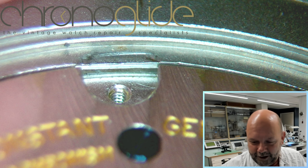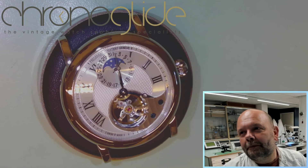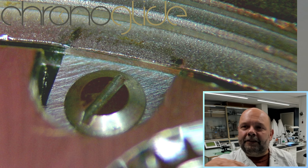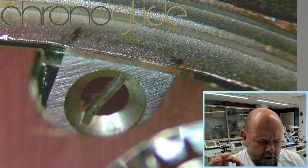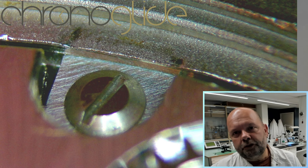I had to adjust the clips and find the proper screws, because as you can see these have really fine thread. I make these plates as a set and finish them just like watch movements. I found the perfect screws with exactly the right thread, but just about all the screws on this watch are blued, and these screws were stainless steel — you cannot blue stainless steel.